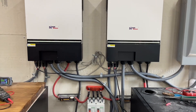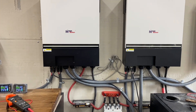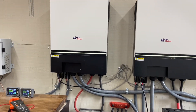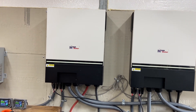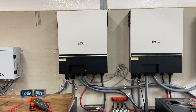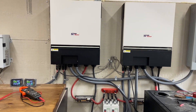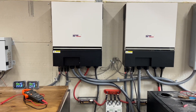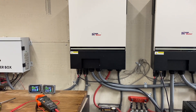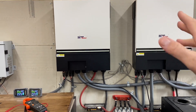When I finally got an answer from Signature Solar, I ripped that off my wall, boxed it back up, and put the LV6548s back up. I'm getting pretty good at it — it only took me a couple hours. They worked perfectly, no strobing. So when people say all Voltronic inverters are the same — Orient Power, Sun Gold, EG4s — I really don't think so. If they are, they've got different manufacturing, with some kind of cheap component in there. Not a fun experience. But for now, these are great, great, great units. MPP seems to manufacture great units.